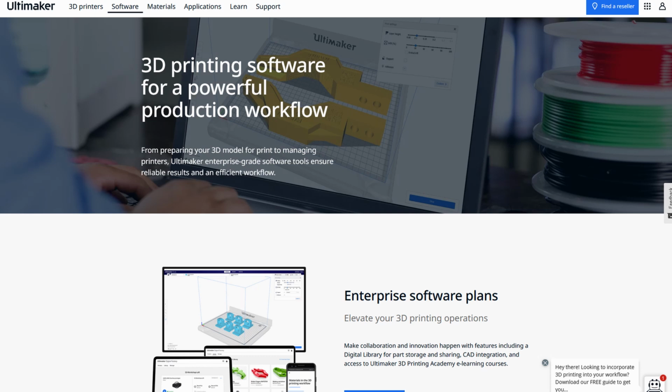The profiles are quite nice for the first printout, but they are not exactly calibrated for your printer. And every printer, even if it's the same brand and the same device, always behaves a little differently. The slicer converts your CAD model, your STL model, into a machine language that tells the printer exactly how to move in the X, Y and Z axis, specifies the speed and also specifies the quantity of filament to be extruded into the nozzle.